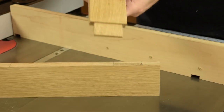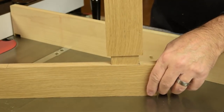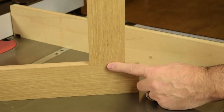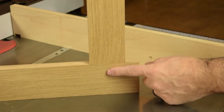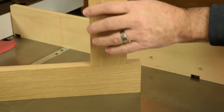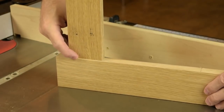If the width on the tenon comes out about right, this sample board should fit nicely into our project piece — and we see that the width of the tenon was just the right size. We'll go ahead and cut those on our real project stiles. One thing to notice: these tenons are offset, so at the back of the frame the boards will be flush, and at the front of the frame you'll have a nice decorative offset — and that's exactly what we're going for.